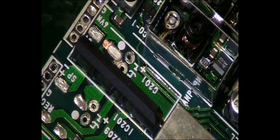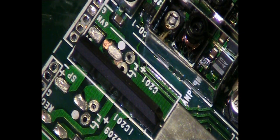In fact, we can tell those two ground pins there are connected together. So if we get the test meter and just make sure we've got continuity between those two pins, we should be good. Let me get my very fine probes out. We'll get a continuity buzzer out. There we go, that will do. And we'll just check continuity in there before we progress. We want to check between that point, which is a ground, and that point, which is a ground, and we're okay.